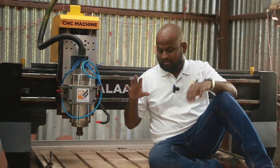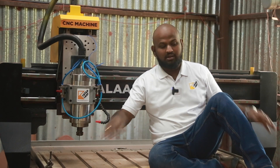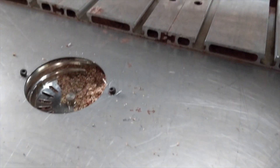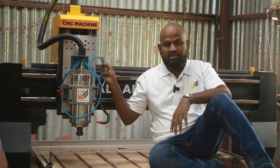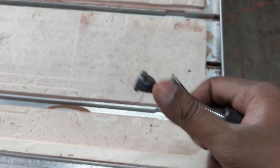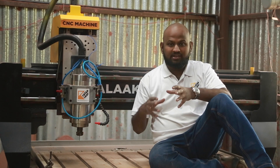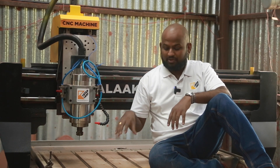The bed I'm standing at right now is made of steel beams, on top of which there is a stainless steel border that can hold water. At the back there is a drain sink through which the water goes back into the tank. The tank is connected to a motor which pumps water through pipes to cool the bit. Above the stainless steel border we have aluminium rails with guides that hold bolts acting as clamps. Above the aluminium rails there is a PVC sheet acting as a wasteboard, so any mishaps in cutting damage the PVC sheet rather than the aluminium.